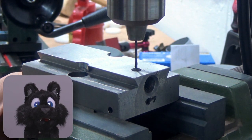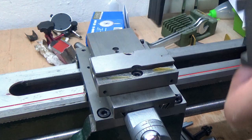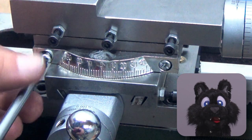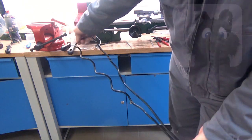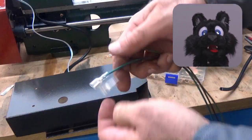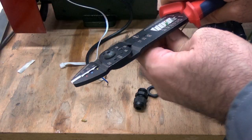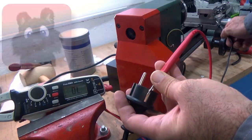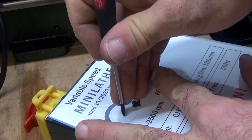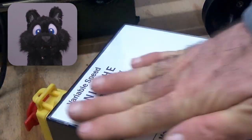I'm drilling a hole at the end of the crack in the tool sled base to prevent the crack from spreading further. That plastic angle goniometer is another planned upgrade. And now, electrical work! The lathe comes with a way-too-short cable, so I swapped it out for one I had left over from a garden pond pump. Everything is well-grounded! I also remade the labels for the lathe — the original ones were dirty and did not come off in one piece for the paint job.